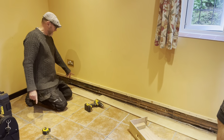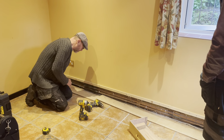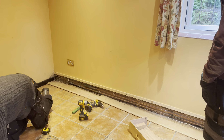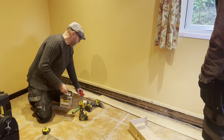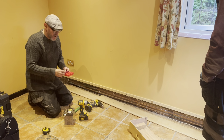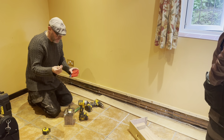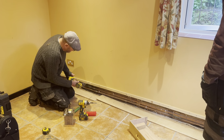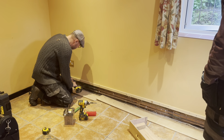So we've started to get the battening on. It's just a case of having the right tools for the job — a hammer drill, and appropriate size screws. I'm using 50mm screws for these. And reds — reds are really good, they're a universal plug and you're going to get a really good fixing. So that's 6mm plugs. We've got one in there already, it's holding, and we just need to re-fix this to make sure it's really tight and firm on the wall.